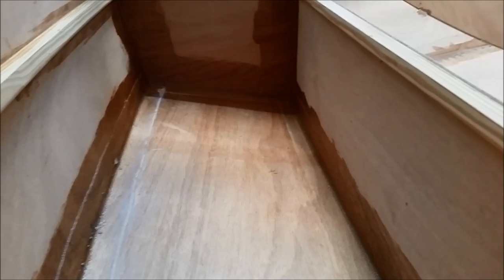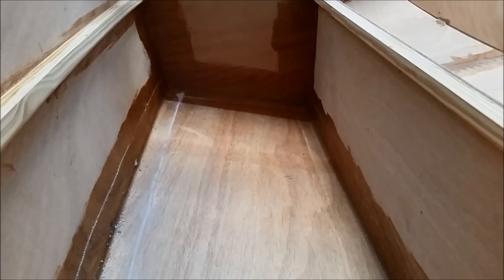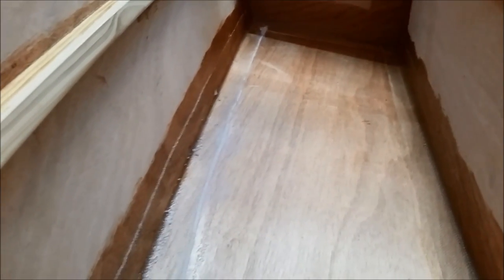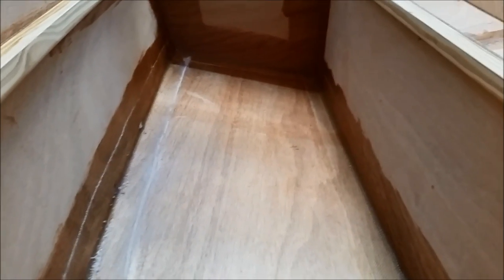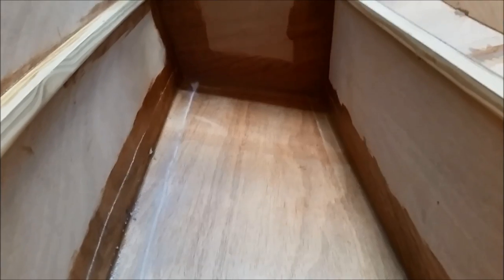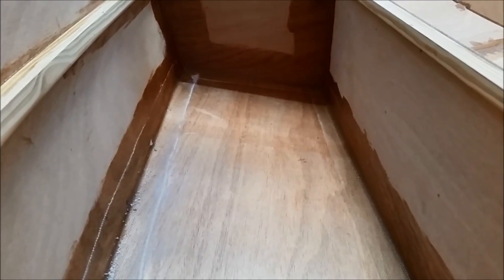It's been about 12 hours since the glass taping and the epoxy is still in the green state — it hasn't fully reached hardness yet, so it can be overcoated with more epoxy without having to be sanded.